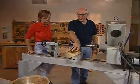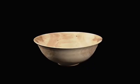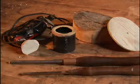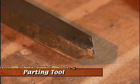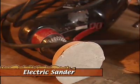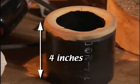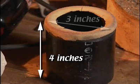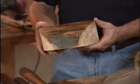Master wood turner Dave Hout is about to help me turn my first project, a basic bowl. To make the bowl, here's what we'll need: a 5/8" bowl gouge, a parting tool, an electric sander with 100, 150, and 220 grit sandpaper, a 4-inch section of PVC pipe that measures 3 inches in diameter, and a block of maple wood. The piece to be turned is called a blank.